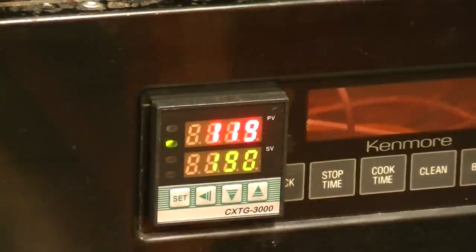The normal oven controllers, like what came with this Kenmore, are not going to turn the elements off until it gets to 190 degrees. That means you're going to ramp way past 190 before it levels out. With fuzzy logic, it logs how quickly the temperature is rising, and it predicts at the current rate when it's going to reach 190 degrees - my set value. So with fuzzy logic it will decide to cut power at say 176 degrees, and if it cuts power then, for lack of a better term, it will coast to 190. It is able to very accurately control the temperature.